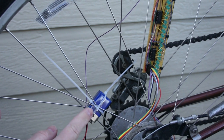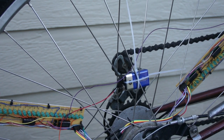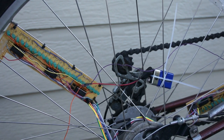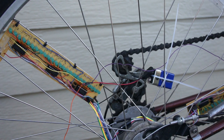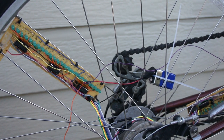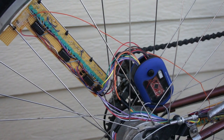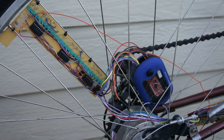So I had to add another battery. The model I have is capable of 4 volts up to about 24 or 28 volts, so hooking up 9 volts to this was no problem. It has ground in common with the rest of the system, but when the sensor is triggered, it sets its signal pin from high-Z to ground — digital low. There's really no way for it to introduce the 9 volts into the rest of the system unless something goes horribly wrong. With testing, this turned out not to fry my system, which was a really good triumph. Also, if I had a higher-power board running off 5 volts, I'd be able to drive the Hall Effect sensors directly without any need for a separate power supply.